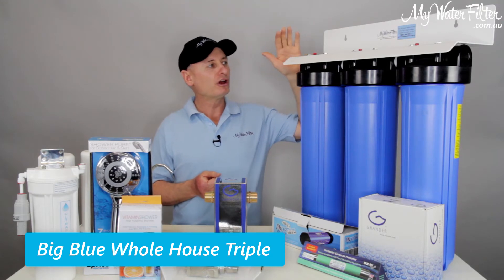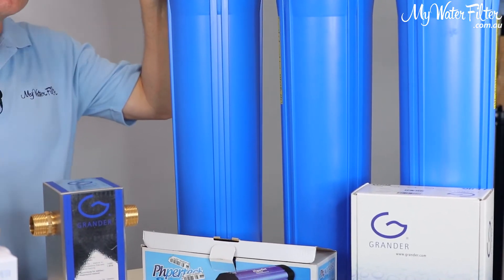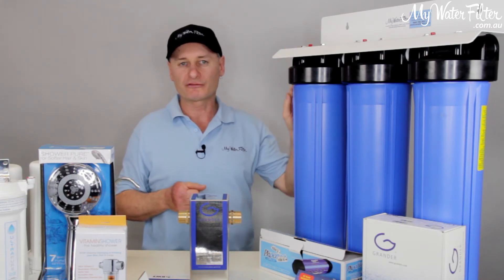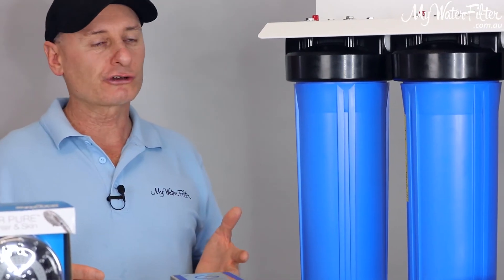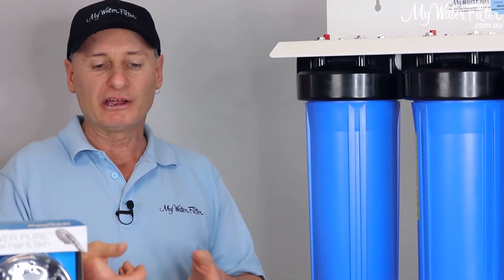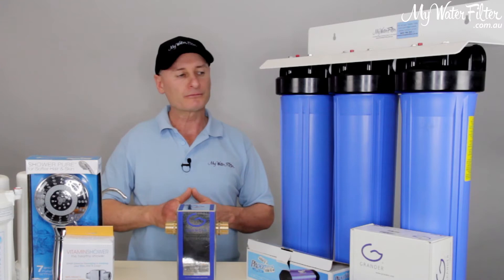So the ultimate way, without a doubt, is to put a whole house water filter on your house. There are different styles and sorts, and I like these ones. Water filtration is getting better all the time, new cartridges are coming onto the market, and with these style here, whenever a new cartridge comes on the market, the next year when you go to upgrade your cartridge, you can step up to a better cartridge. If it's just the chlorine and you want a beautiful shower, nice water for the washing machine, or at the kitchen sink - if you're washing spaghetti and rice and want the chlorine gas smell gone - a whole house water filter is perfect. The water goes through sediment, carbon, carbon - it'll strip the chemicals and the chlorine out, and you'll have beautiful water throughout your whole home.